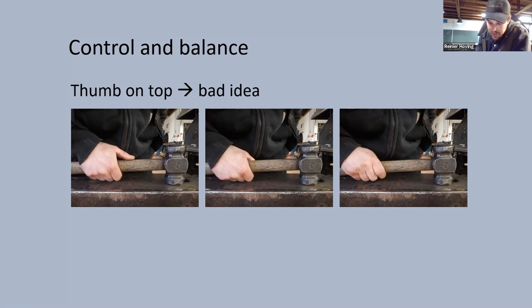My wish was to research this subject with people who know how the human body works and visualize what happens while forging. I was talking with Patrick about this matter and he saw a possibility to consult an expert. As it turns out, the thumb on top is stressful for your tendons and should be avoided. When forging, the hammer bounces back after hitting the anvil, and if your thumb is on top of the handle it receives the first shock of the rebound. This shock on the tendon attachment travels through your arm all the way up to your spine and could damage all these areas over time.